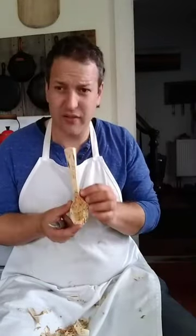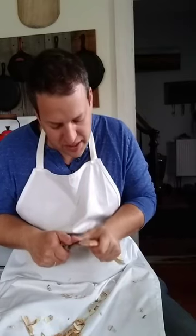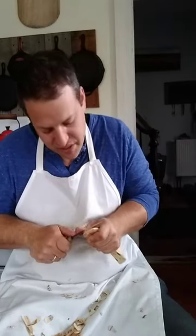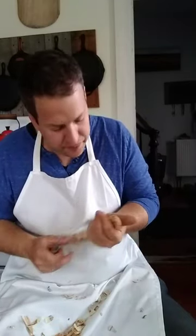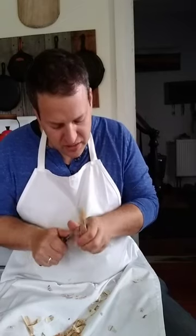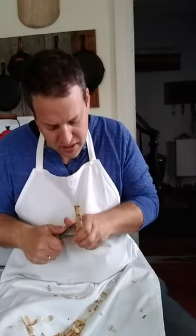And the problem is that spalting doesn't last. The wood darkens and grain patterns fade as the spoon ages. And so you're suckered into this sort of temporary, beautiful thing that keeps you from pushing the spoon to what it should be, because, ooh, it looks like an owl right now or something like that. You know what I mean? And in the end, the only thing that's going to remain is the form.